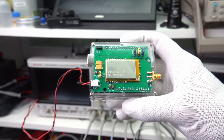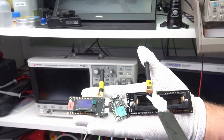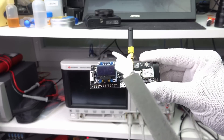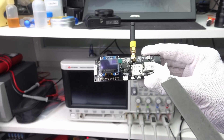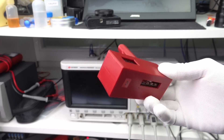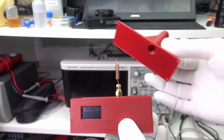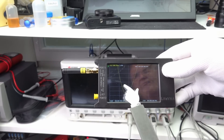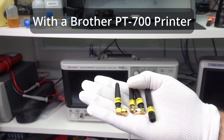You also get a wide choice of boards with these modules connected to a microcontroller, a display, a battery, etc. If you buy such a board with an ESP32 chip, you also get 2.4 GHz Wi-Fi and Bluetooth. For our project, we will use this T-Beam. It is convenient for all sorts of trackers because it not only has a battery and a display — it also has a GPS chip. If you print this cute case, you get a rocket device. If you want to use the antenna protector, you have to remove the plastic from the antenna, otherwise your antenna will resonate far away from 433 MHz. I always measure and test my antennas with a Nano VNA when I get them, then label them so I do not mix them with 868 MHz or 2.4 GHz antennas, which look very similar.